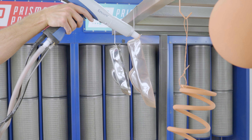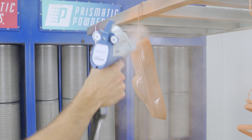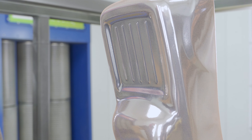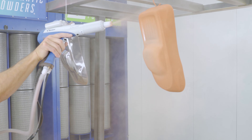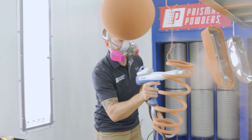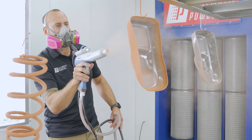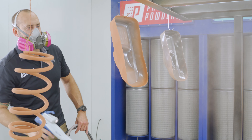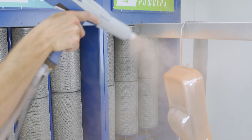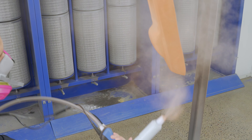These little truck bodies are not tricky to shoot, but there are areas that are not as easy as the rest — in this case, it's the truck bed. There are ridges and angles where the powder doesn't lay as easily, so I'm going to spray the truck bed last. The indirect spray angle I have when spraying the rest of the truck body will help fill in some of those ridges, and then all I'll need to do is touch up what's left.